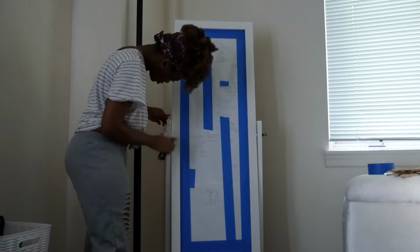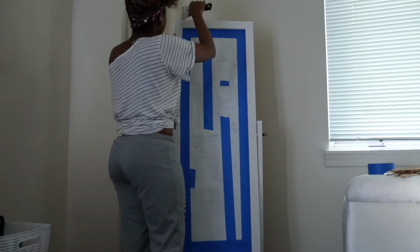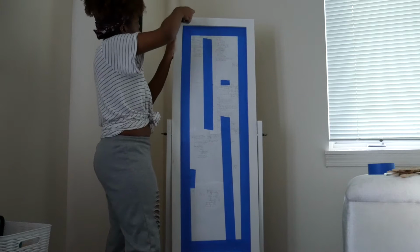So to fill in the cracks, it's very simple. You just go ahead and work the Liquid Nails into the crack. When I opened up mine, it's like busted and I got a whole bunch on my finger, so I'm just using that. But go ahead and work it in, and then we're going to use a putty knife to make sure that everything is nice and smooth. And so I got mine from Walmart, but of course everything will be linked in the description box as well. But you want to use the putty knife, mine is a flexible one, to work it into the cracks. You want to make sure that they are properly filled and sealed. So I just go ahead and do that to all of the cracks. And don't worry if it's not super smooth, because we're gonna fix that a little bit later.